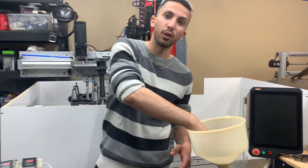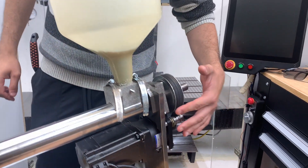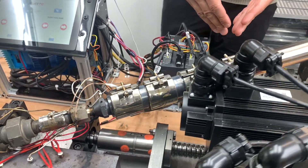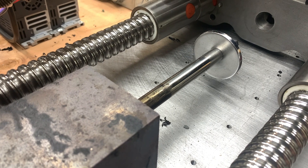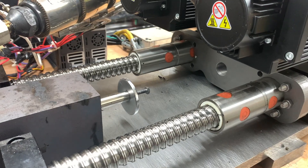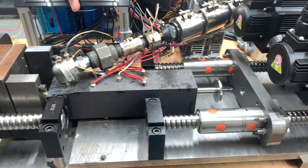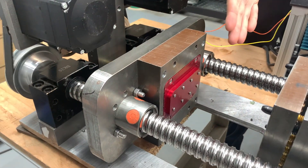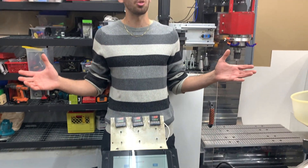Our finished fully automated garage-sized plastic injection machine starts right here with the virgin plastic pellets. We can use any plastic but right now we're using ABS. This plastic travels down the hopper into a reciprocating screw driven by a geared stepper motor. As the plastic travels through the reciprocating screw chamber it's heated with band heaters, and as it's plasticized it travels through a one-way valve into the injection chamber. As the plastic fills this chamber the floating ram travels all the way to the back, and once it hits a limit switch the ram injects the plastic. As that injection happens the plastic flows straight into the mold, the mold cavity fills up, the mold opens, and the pins push out the plastic piece. This process repeats and the entire injection machine is ready to go through as many cycles as the molds can handle.